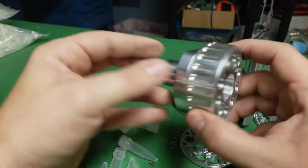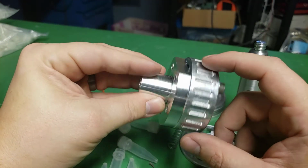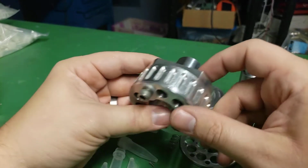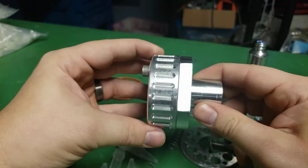And you put those in, and then now you can hold this in a collet to get access to this whole outside. And then the reason there's a flat is so when I put this in the collet, I can run an indicator across here. I can use this to determine where's my starting point.